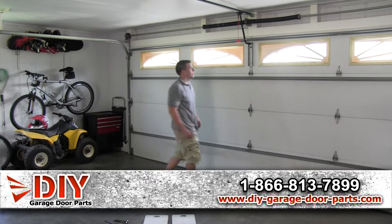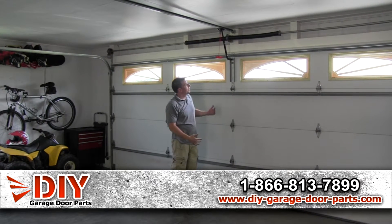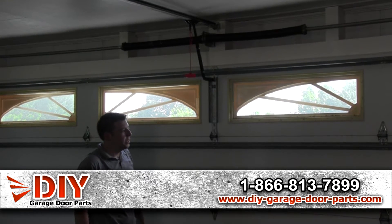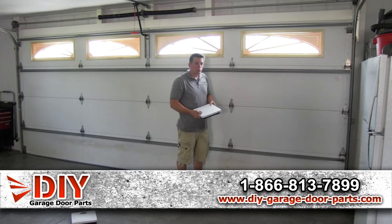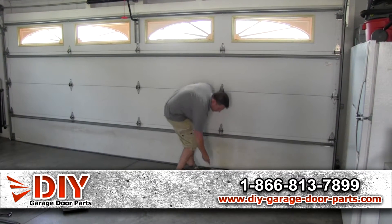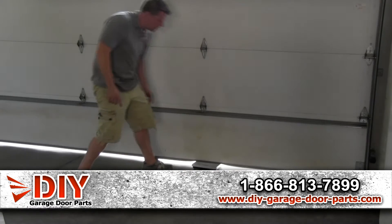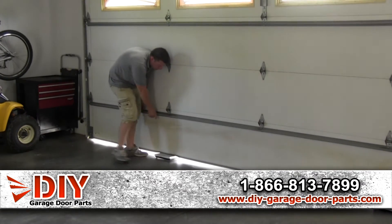The first thing we're going to do is come over to the garage door opener emergency release, pull it, and make sure it's released so all the door weight is on the ground. In this situation, we're going to pretend one of these springs is broke. We can't actually weigh the door with one good spring because we're only going to get approximately half the door weight. So what we need to do is take our bathroom scales. I like to put one over on this hinge side. You can use one scale if you have a small door, like an eight-foot or nine-foot door, but in this case it's an 18-foot door. Make sure the scales are zeroed out, then lift the door — it's probably going to be heavy, so you may need some help — use your foot, slide it in to the hinge, and lower it down. Get your other scale and do the same thing: raise it up and slide it in.